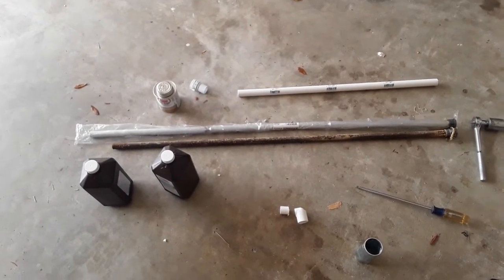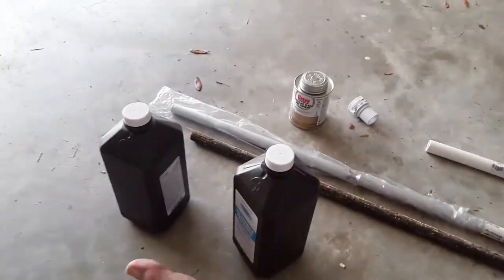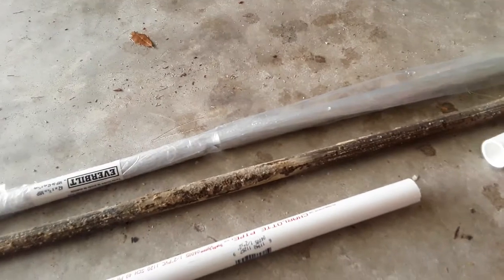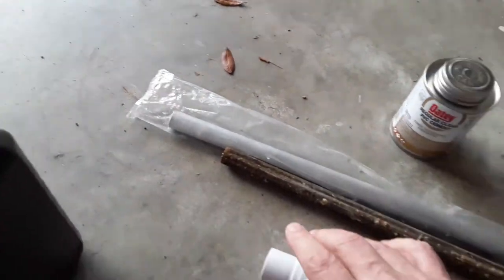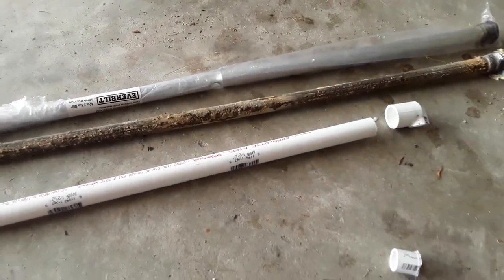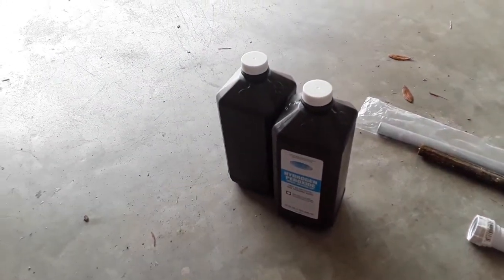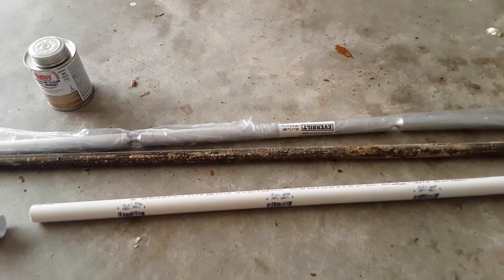For now I'm just going to wait for it to drain, and then I'll show you how I'm going to use that stick to flush out the bottom. I'm going to put the right angle on, glue it, and it's really narrow so it fits in the hole. Then I'll put a hose bib on so I can force water through and aim it at the bottom of the tank, get it all mixed up, and flush it again. Then I'll start pouring in the two quarts of hydrogen peroxide, fill it up, and let it sit for about three to four hours.